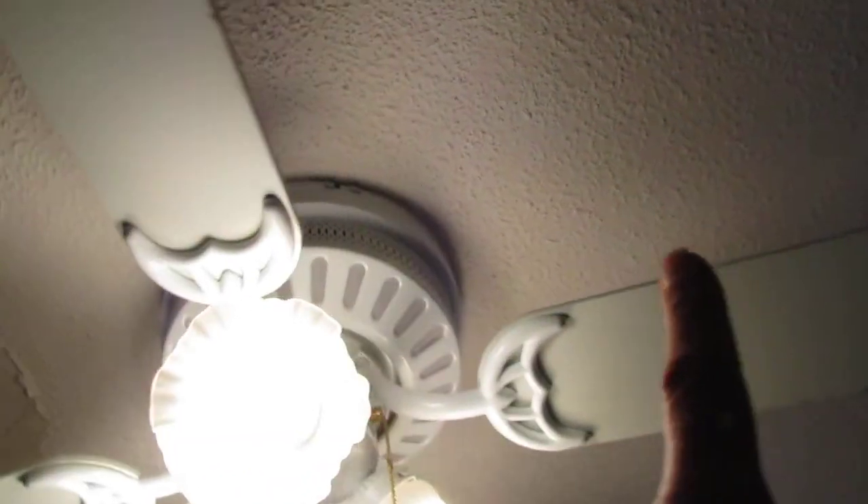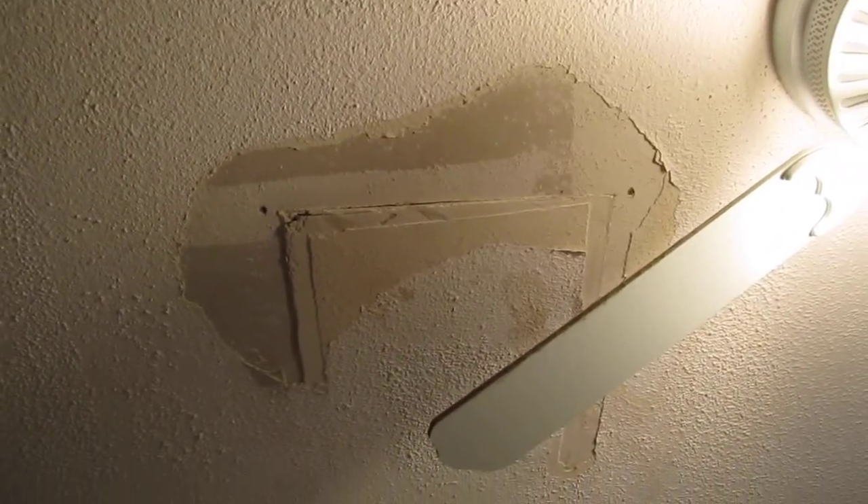We use a feathering method. We'll tent this area that will go to the wall out probably a foot. We have to take your light down, and we will go past the receptacle a little bit, then come back in. Let's call that two feet wide and probably four feet long, so we can't get a two-by-two chunk — we've got to get a four-by-eight chunk and cut a little bit off.